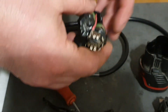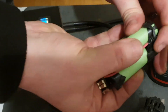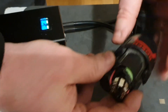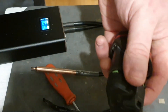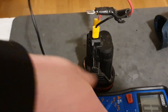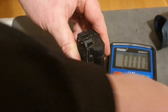I'm setting the pack back into the casing. There's some insulation to tuck in, but I'll get there. The casing is on now and I'll get the lid on. I had it in wrong at first but it's sitting right now. The good news is I got it back together and it's charging. Here's the battery fully charged - checking the voltage: 12.18V. That's fantastic, so that fix has worked.